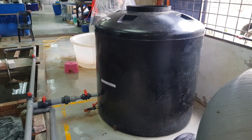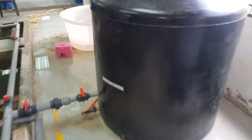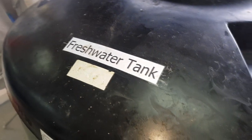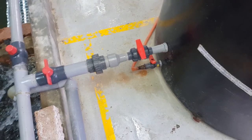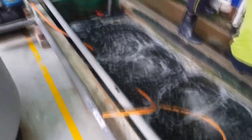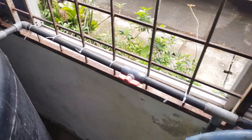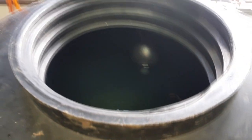Before going into Chinese New Year, we actually made a bunch of productivity improvements on the farm, and this is one of them. This black tank is basically used to store fresh water. For those who have been following our channel, we convert fresh water into salt water by adding salt. The fresh water comes from the municipal water supply and is introduced by a series of valves and pumps into the system. What we have done to maximize productivity is we have made this tank auto top-up. Water comes in from the municipal supply and goes into a float system whereby a float switch is used to maintain the water level. This works exceptionally well especially during periods when you do not have water, and it always ensures that you have full storage of water before going into the farming process.